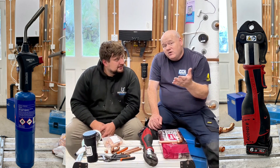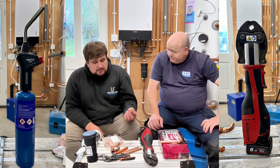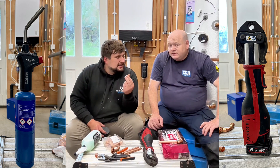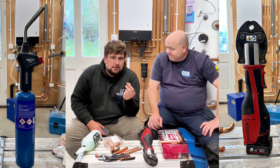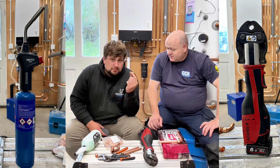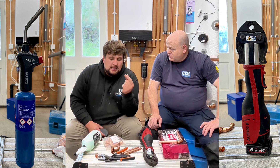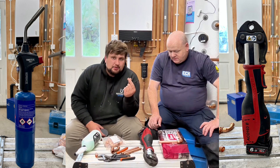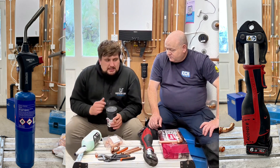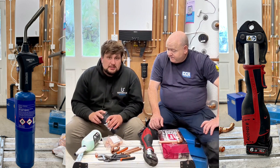Put a comment below and let us know what you think. Now, soldering — obviously the price per fitting is cheaper. If you're self-employed and working for yourself, especially on domestic, and you want to bring the price down for yourself and your customer, end-feed could be the way forward. The downsides are you may need to sign a hot works permit.